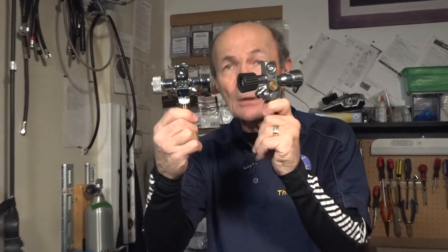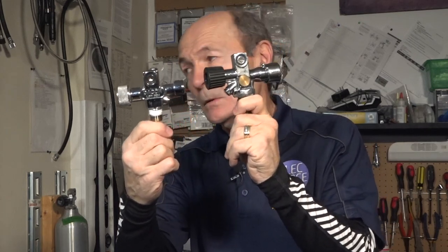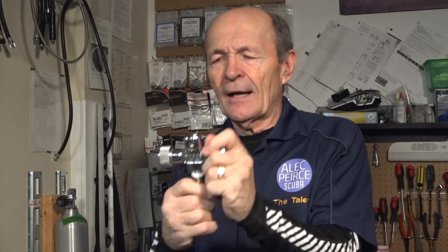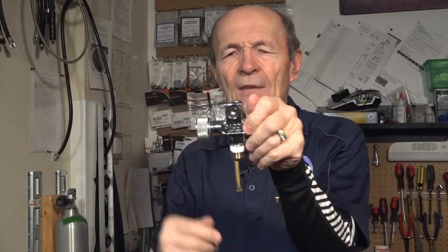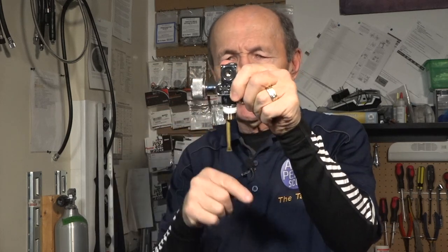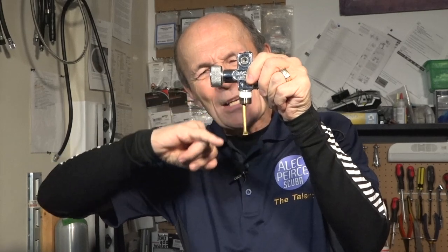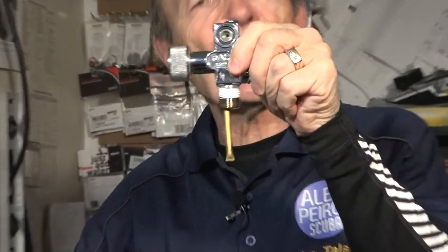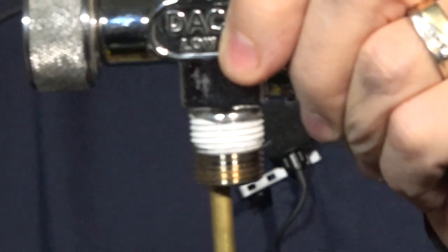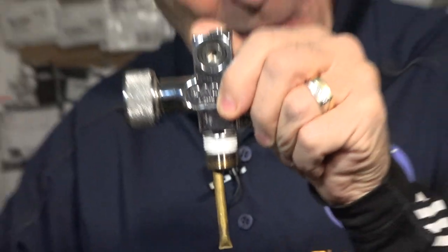Both of these have a reserve on your right side, and a knob on your left side, okay? But if I take the one I just took out and hide that, again, you've just got a standard scuba tank valve, right? Yoke goes on here, knob on and off, threads, dip tube. But you see here on these threads, you see what's at the top? There's something white up there. What the heck is that? Well, that is Teflon tape. So these days, when we install a half-inch valve into a scuba tank, we use Teflon tape. And this is critical. Very important.